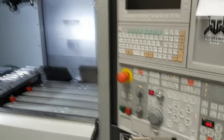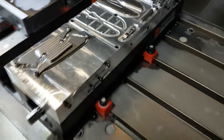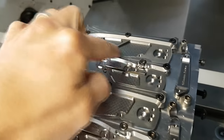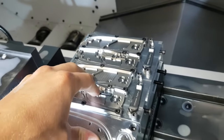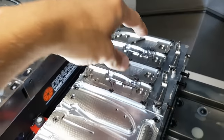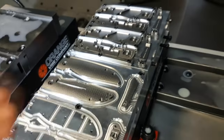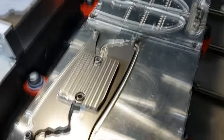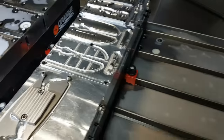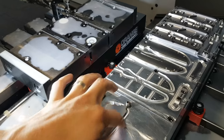The new fixture is working fantastic! I'm in the testing process — chunking it, doing the handle backsides. I got all that code dialed in. Had some problems, had an end mill break, had to dial in the speeds and feeds — not a big deal. I didn't scrap any parts, just scrapped a few end mills. They look awesome now. Handle top sides look epic. This is the crosshatch pattern — I've got three patterns. These parts get flipped onto here, new parts go there, blades get roughed out in this section. After this they go over to the side over here, which I haven't worked on yet. It's already three o'clock; I was hoping to get it done today. I think the code for this is done now, so let's run that and see what it looks like.